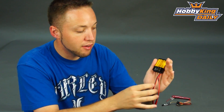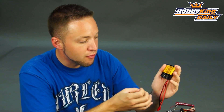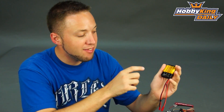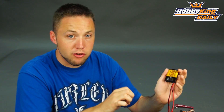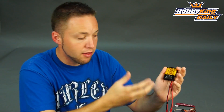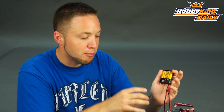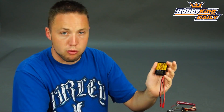As I mentioned, dual redundancy voltage regulator. What makes this very nice in comparison to a standard regulator — most helicopter voltage regulators are basically just an input from a receiver pack and then output directly to the receiver. So all the current for your servos and any other electronics are run through the receiver still. What's nice about this is it isolates that power, so it's a bit safer and it keeps from drawing all that current for high-power servos through your receiver directly.